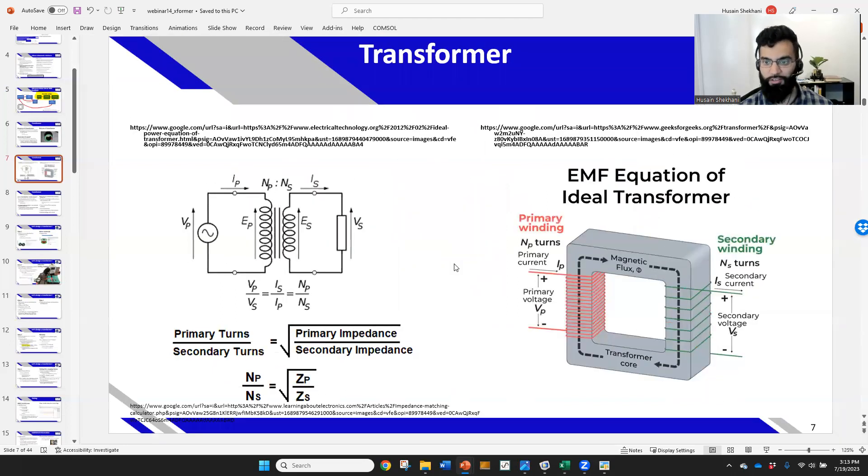The ratio between the primary voltage and the secondary voltage equals the number of turns on the primary compared to the secondary. The current ratio is the opposite, to conserve power — a transformer does not create power. It is a power matcher. Whether you call it a matching circuit or not, it allows your amplifier to be better suited for your load.